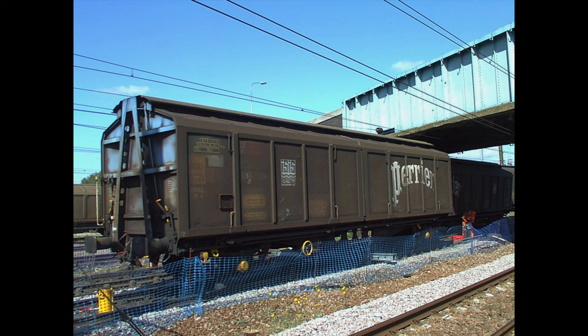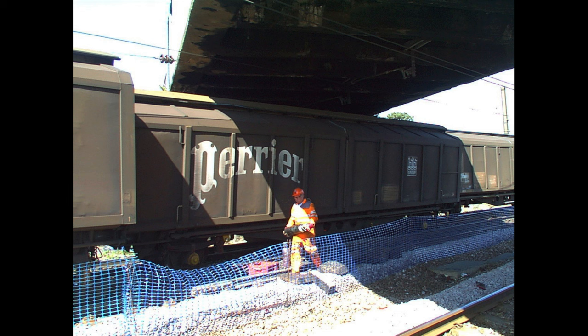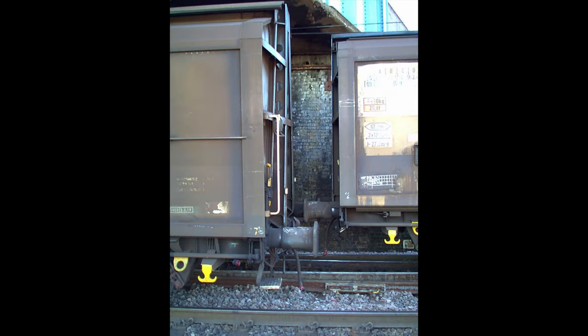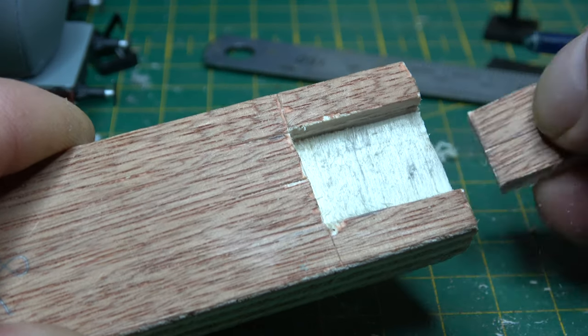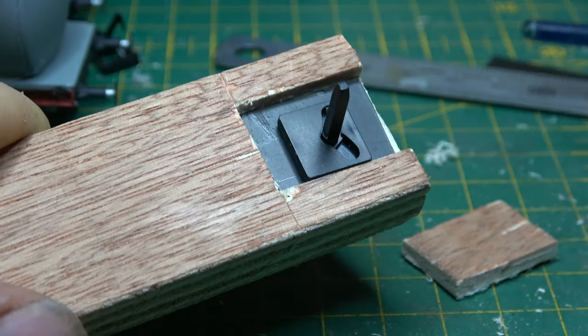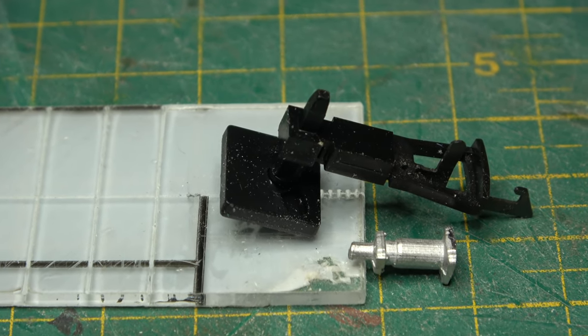These and other similar wagons are designed with a certain degree of flex in the chassis, which is all right when they're loaded because the weight in them pins the wheels to the rails. The heavier the load, the more flex in the chassis, which means they will stay on more contorted track. But as soon as you take the weight out of them, there's nothing to hold them down, and if they go over adverse cambers, point work, or rough track, it can sometimes bounce the wagon off the rails.